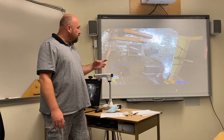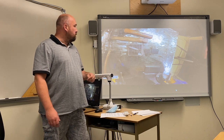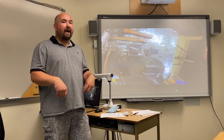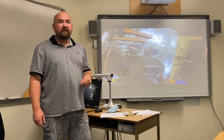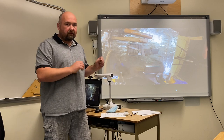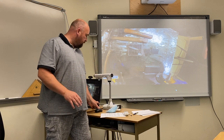When you get your plate given to you, you're not allowed to use a grinder anymore. The inspector is going to give it to you, tell you to prep it, tack it, and bring it back to him for him to stamp it. When you're taking it to prep it, you're going to use a grinder with a wire wheel on the end and wire wheel the mill scale off the plate. Clean any rusted spots off the plates — you want to clean them up spotless so that you're ready to go.